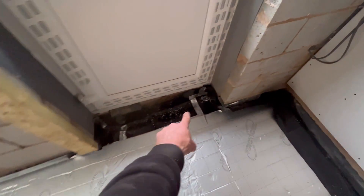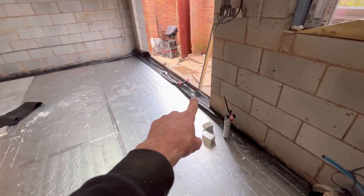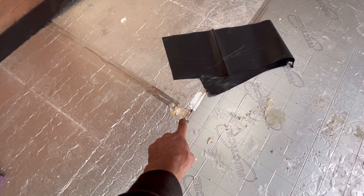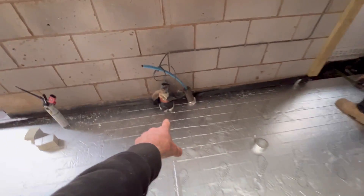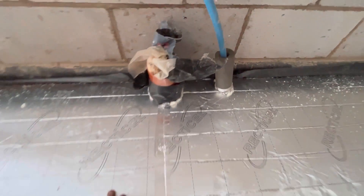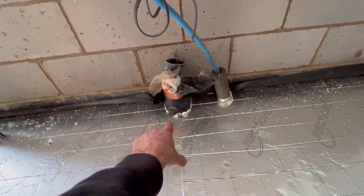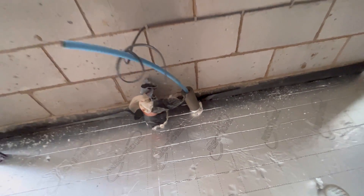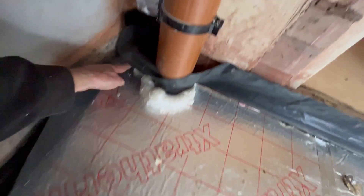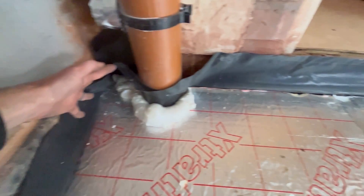All we've got left to do is put these last pieces in — same in that doorway there. There was a corner missing off that one, so we'll fill that full of foam and tape over it. It's all tight to the perimeter all the way around. We've put extra plastic around this pipe so there's independent movement — they won't move — and we've foamed them in, so they're all good to go. Likewise with that one, we've gone all the way around the pipe, mounted a box in, all the way around, and foamed it all the way in.